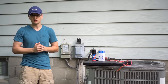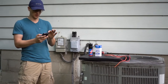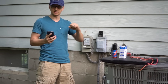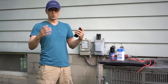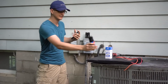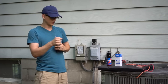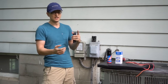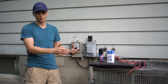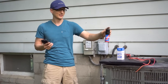If you're wondering why you even need a hard start kit, or when do you ever need one — what a hard start kit does for the compressor on an AC is give it a boost, and that compressor actually starts up like 10 times faster than it normally would. I've taken readings with my meter with the amp clamp to see how much amps the compressor draws — for example, it'll be like 70. After I put in a hard start kit, the startup amperage would drop down to like 40, so almost cut in half the startup amps. So it does make a big difference putting in a hard start kit.